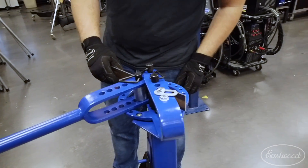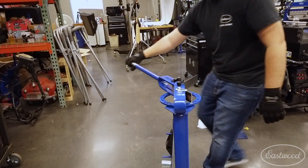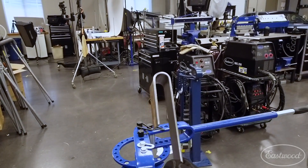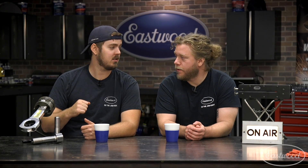I'm going to work on the hold-down straps. I'll get the metal bender and throw some two-inch plate in there — just going to put about a one-inch radius so it holds down the rack and pinion. Make sure all your dies are lined up nice and straight, then one swift pull gives me 180 degrees — just account for spring back. The metal bender let us use a two-inch piece of one-eighth-inch stock and bend 180 degrees in about 30 seconds.